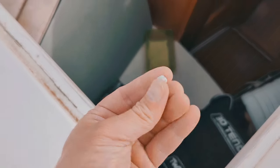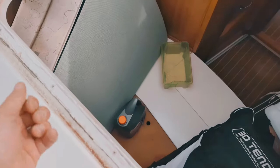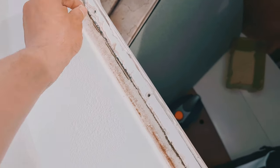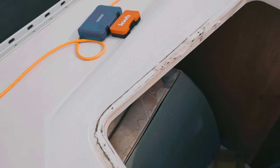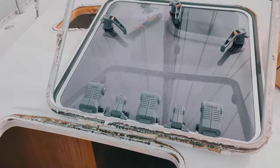We've got a few hatches to do because several of them leak, including the great big one at the bow in the forepeak. I wasn't looking forward to this job because getting the port lights out was an absolute mission. But the hatches seem to have been put in with butyl tape, which just comes off in putty-like balls — it's a lot easier than silicon adhesive. And this is the big hatch off now.